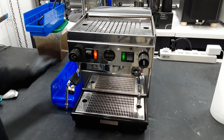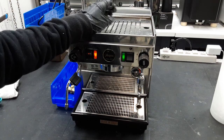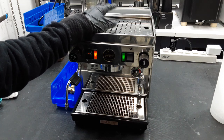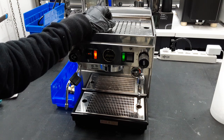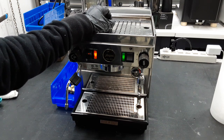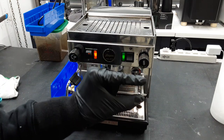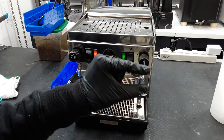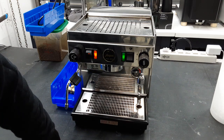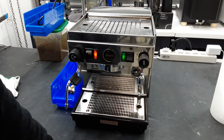We also cleaned and resealed the water level probe and the safety probe. When I pulled out the probes themselves, they were pitch black — there's just a bunch of buildup around those probes, and when the probe can't conduct, it'll just stop working until it can. So your boiler would probably fill only the first inch, which was really dirty. The water would need to go an inch higher for your probes. I de-scaled both of them, scrubbed them clean, and did a conductivity test with a multimeter to make sure they were still working — and they both were.